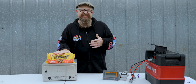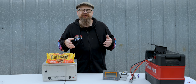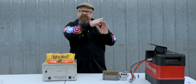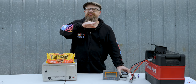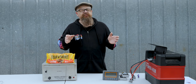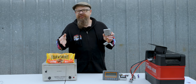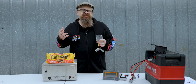There are different battery chemistries to consider. The two main ones are lead acid or AGM — a variation of lead acid — and lithium. When discharging a plain old lead acid battery, the voltage drops off substantially, which a step-up converter will fix. Lithium is a lot better in that regard — as it decreases in capacity the voltage doesn't drop off nearly as much, so you'll get better performance in a Travel Buddy-type oven using a lithium battery. But you still won't get driving performance, and a step-up converter will fix that — so even with a lithium battery you'll get better performance using one.